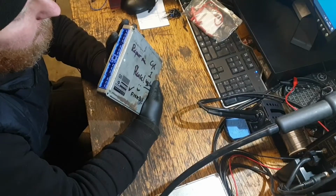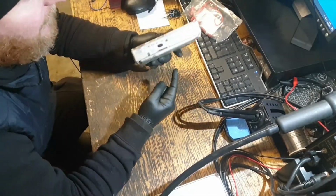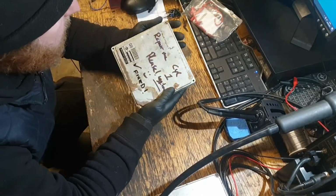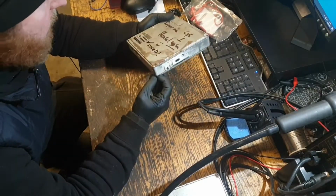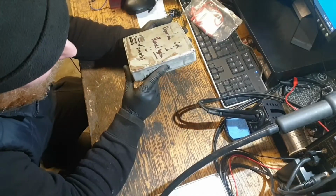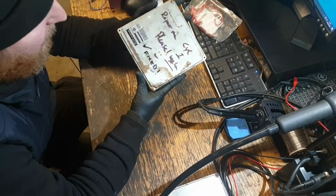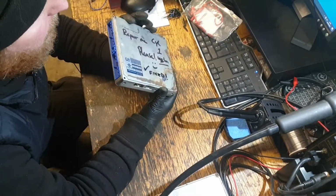But there could be other slight little subtle differences, and even 2 identical ECUs can perform slightly differently if you just swap the chip over. It depends how well it's been tuned and how close to the edge it is, rather. But it's better to repair if you can. It should be rechecked, really, even after just changing that little daughter board, because it shouldn't change the timing, but if it was fueling related, maybe I'd be concerned.